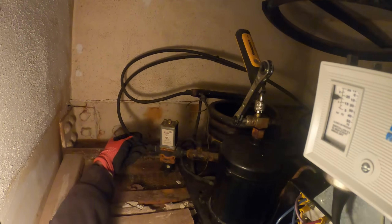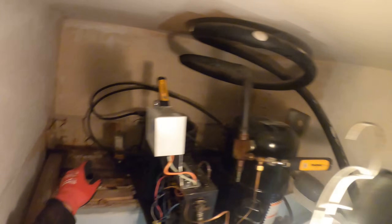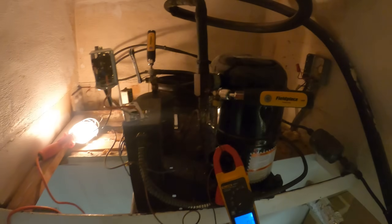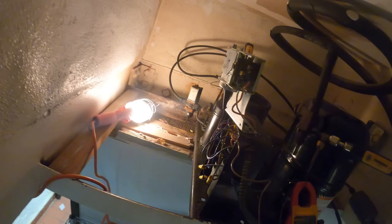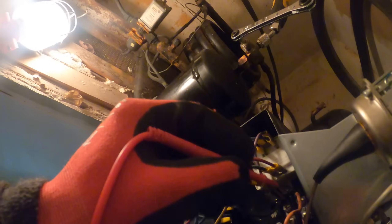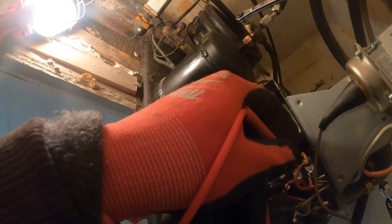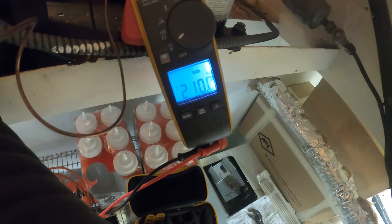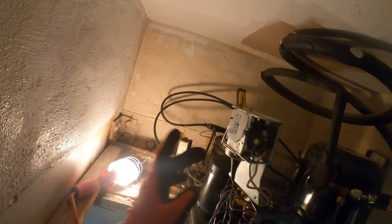This is a water-cooled system and the water is extremely cold. When there's nothing going on in a case like this, I definitely want to make sure there's power coming in. Power comes in through here, follow this to a little terminal block. We are going to go from L1 to L2. We have our 208 — we got our power coming in. Got the cover off this pressure control — could that be holding us out?